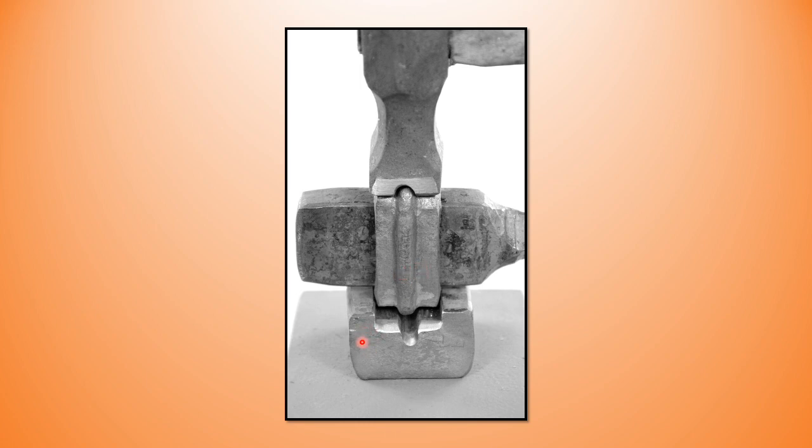I've got the bottom swage for making the collar material. I've got my purpose-built top tool with the piece removed to allow the bead, and I've got my mandrel in place, and I'm just going to give this a whack, and I'm trying to upset the collar material in this area. What's going to happen is I get partial upset, partial bowing of the material. The bow I can deal with later, just like I would deal with shrinking an iron tire on a wooden wheel. It was too big.